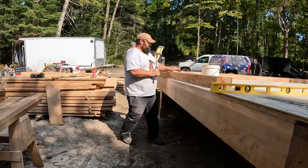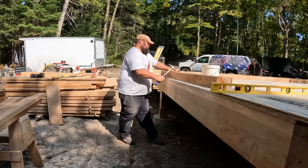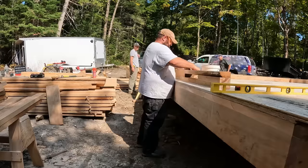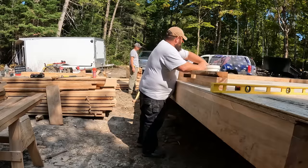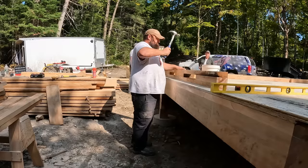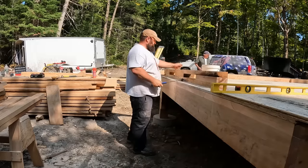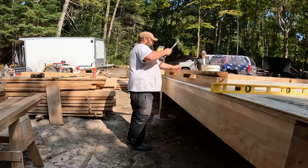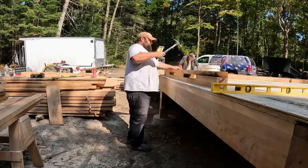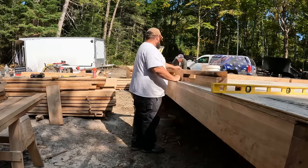I guess this wall had a little bow on it. Yeah, we never strung it. How bad? This is going out by a quarter. Gotta have the wall straight. So Stevie, I'd back this out. Put the stud on the X side of the line. Okay.